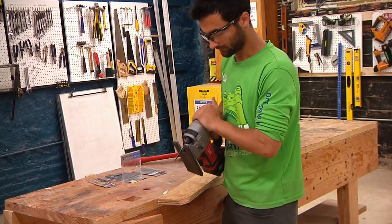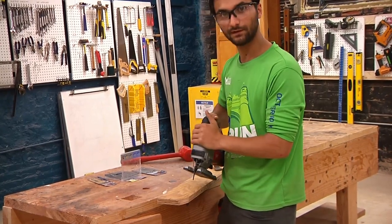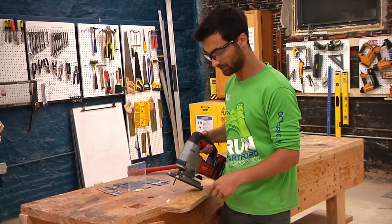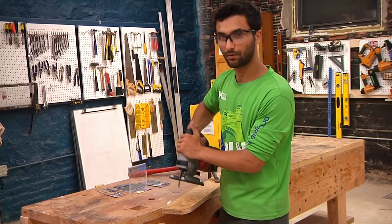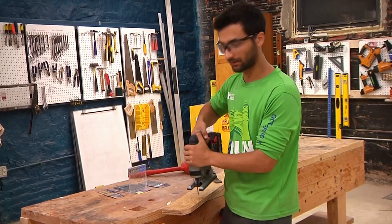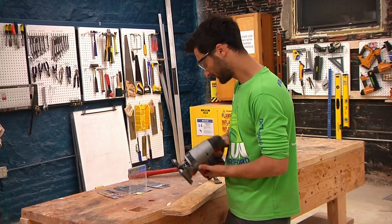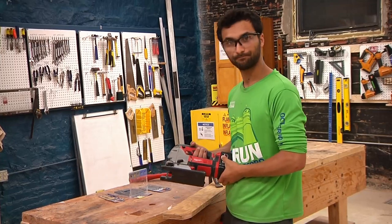I think that's about all there is for the jigsaw. Just make sure to vacuum up when you're done. You can go nice and slowly if you need to. One other thing: if you are doing an internal cut in a piece of wood — cutting out something on the inside without coming in from the edge — you can drill a hole that's just a bit bigger than your blade, put the jigsaw into that hole, and then cut around. That lets you do an internal cut. In general, that's a much better option than trying to come in at an angle, as these blades really aren't made for that. So that's really all there is to using this Milwaukee jigsaw — thanks for watching.